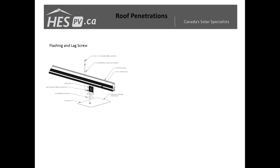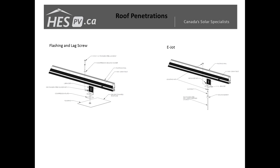Starting from the basics — how are we attaching to the roofs? We have three major systems. One is our flashing and lag screw method, typically used for asphalt shingled roofs, where we have our flashing with a rubber sealing surface and a compression plate which mounts to our L-foot and then is lagged into place with a sealing washer. These are great in that the flashing helps reduce water ingression into the roof and they're quick and easy to install.